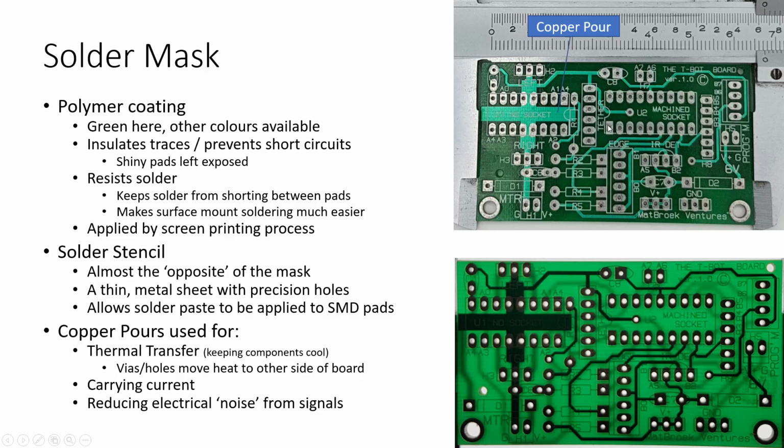And of course, the numbering on the DIP chips starts with pad 1, 2, 3, 4, 5, 6, 7, 8, 9, 10, 11, 12, 13, 14, 15, 16, 17, 18. So an 18-pin DIP socket would go right in there. And again, typically you mount a socket in there so that you can then press and remove your rather more expensive and more delicate chip from there.